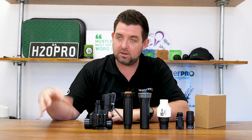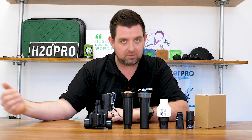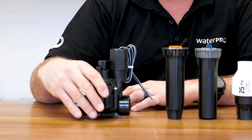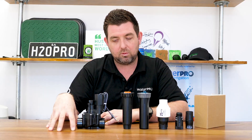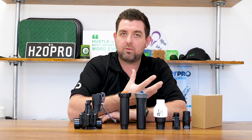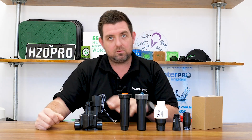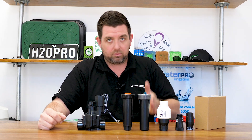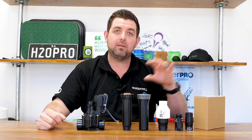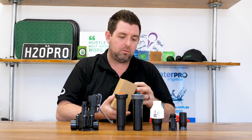Residentially, say in South Australia, a lot of people may have 800 kilopascals or 1,000 kilopascals of pressure coming into their house. That's fine for the solenoid valves to handle — these valves are rated to 1034 kPa. But once you start getting down to polypipe and drip tube, polypipe for example is rated to 400 kPa. So we need to reduce the pressure coming into the system to 400 or 300 kPa to get to the point where the sprinklers are operating at their optimum and the pipes are safe and not going to blow.